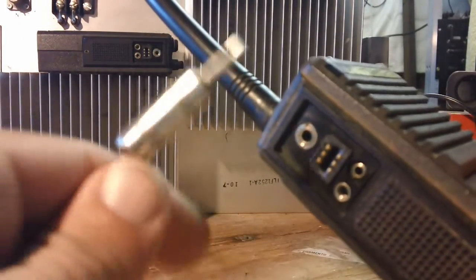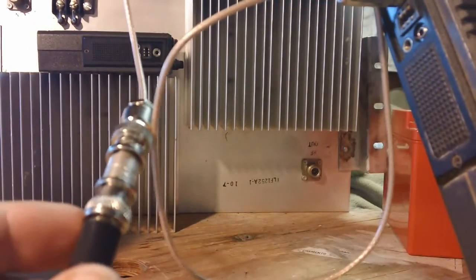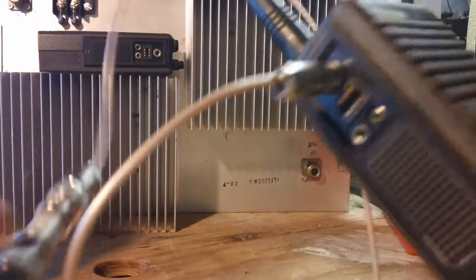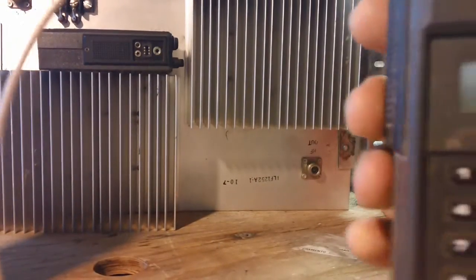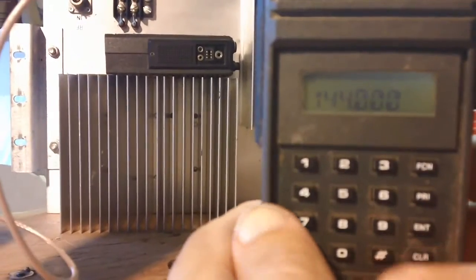This jack here is actually an antenna port out, and I can use it to connect to my test equipment. It can also run outside to an external antenna for better efficiency — just a tip. The port can pop out so be careful. Here I am at 144 MHz — it doesn't transmit on test equipment yet. Switching to another channel — group one, MURS one — I do transmit, good to go. So on 144 MHz it doesn't transmit because it's not designed for that frequency; it's locked out.